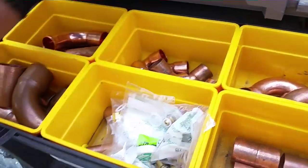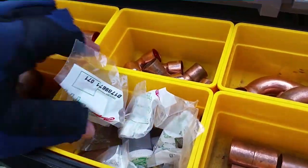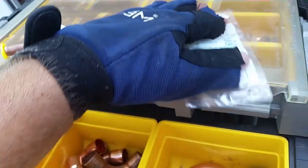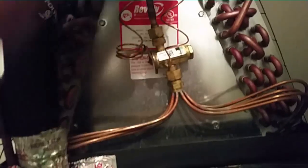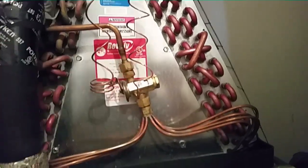I'm going to be using a piston on this job, taking that TXV out. This is my sight glass. I have some pistons here and I'm looking for a size 71 — there we are. That will be a good size for our 3-ton unit. We are going to remove this old TXV, take it loose here, take it loose up here, remove the sensing bulb, and not put a piston in while we're blowing it out — then put it in when we're done.